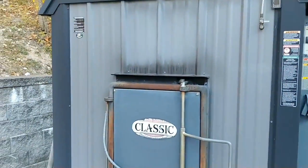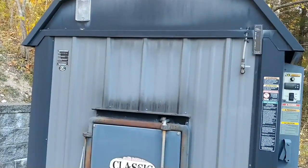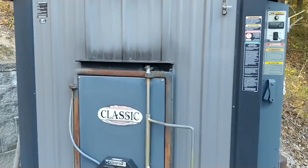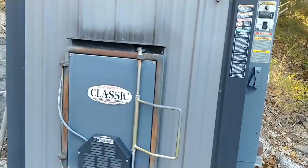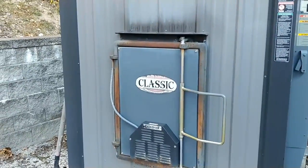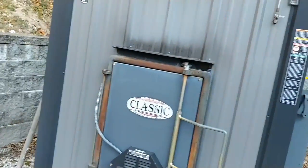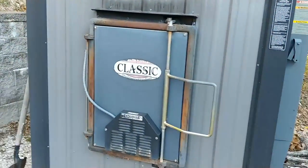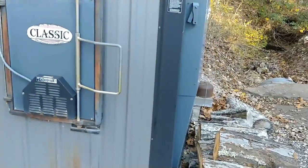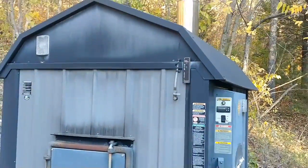The reason you build your fire so close to the door is that allows the heat to travel the full length of the roof before it goes out the chimney. Even though it's a four-foot-long fireplace — or longer than that actually, I could probably put close to a five-foot log in there — you want to have most of your flame toward the front. So I only build a fire across the front, completely full all the way across, but only really one log deep. And then that heats the water and it's more efficient that way. At least that's what they tell you when you buy one of these.